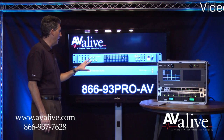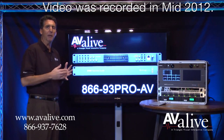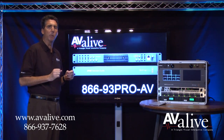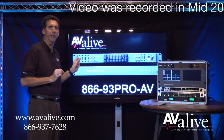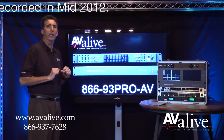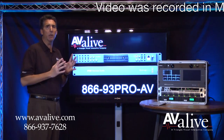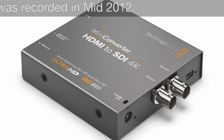Let's talk about HDMI and SDI for a second. HDMI can be utilized in the standard frame rates, both progressive and interlaced, but the key thing to be concerned about with HDMI is cable length. HDMI cable length for full HD is really limited to about 15 feet unless you use an amplifier or an extender, so it's not ultimately cost-effective unless the cameras are nearby. HD-SDI on the other hand, with high-quality cable, can go 200 feet. For situations where you have HDMI cameras but want that distance, one recommendation is using an HDMI to SDI converter from Blackmagic, which retails under $300.